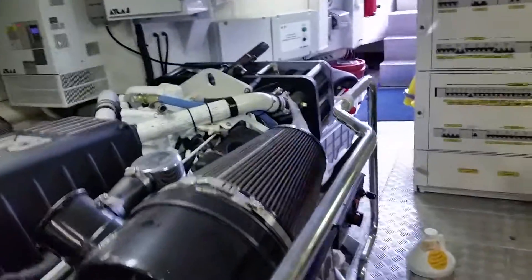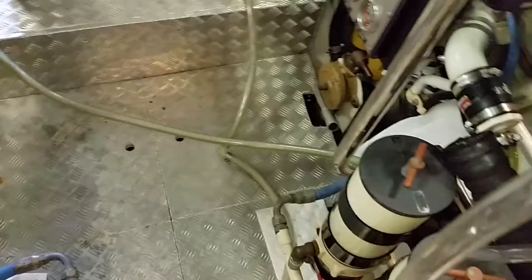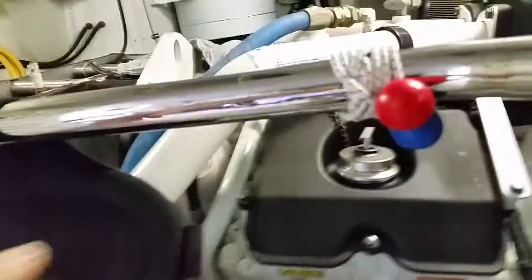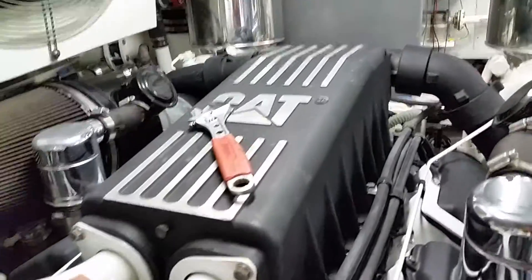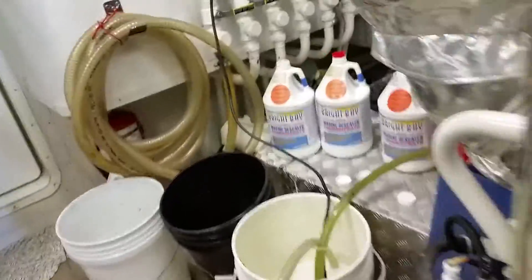As you can see, I started on the back of this Caterpillar — it comes out to the top left-hand side and then out the bottom, traveling back to the back side of the other Caterpillar engine. It goes in through that line behind the air filter, comes out through here, then in through there, out the heat exchanger, across to the top side, out through that pipe into the Caterpillar intercooler, and then back out this white pipe down that line, recycling back into the five-gallon pail.